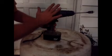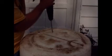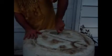Now the plastic on here is approximately 1/4 inch thick. So that's an awful big task to ask of your utility knife. So what I'm going to do is use my drill with the drill bit and go around the edges, and then I'll fine tune and make fine cuts with my utility knife. Alright, there you have it. It took me a while to get the adjustments made, but that is perfectly fit in there.